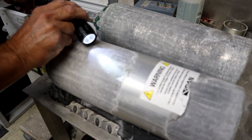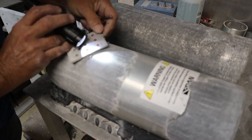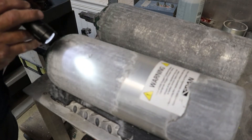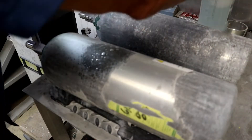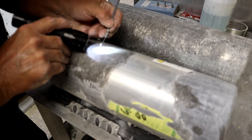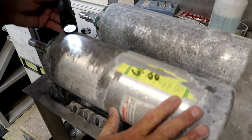Another way to test the actual depth of a pit is to get a pick and see if it gets stuck in it, then compare to the pit gauge. I don't even think it's at 0.01 — it could be less. But that's definitely pitting. If it would have had more time with all the corrosion on it, those pits would grow and get deeper. Let's see if wetting it gives a better viewpoint — there's some more pitting there, but very shallow. I would have thought the pitting would be a lot deeper on these tanks, but no, it's very shallow.